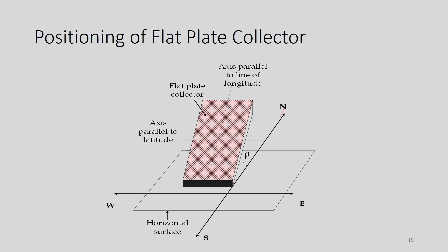To position a flat plate collector: it must face due south to get maximum exposure to solar radiation. The collector needs a frame to hold the structure and some civil work for installation, and hot water can be collected from the storage tank and piped for day-to-day use. The installation must maintain a tilt angle to maximize solar radiation exposure.